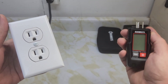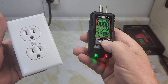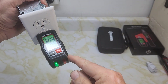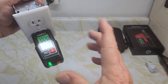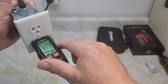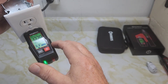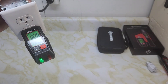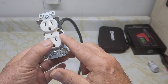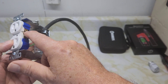The best part of this kit is the outlet tester. Plug it in and it shows 122 volts, correctly wired. Now I'll use a prop outlet to demonstrate different wiring scenarios to show what the transmitter tells you about your electrical wiring. Currently it's wired properly: the live black wire is on the gold screw, the neutral wire is on the silver screw, and the ground wire is connected.